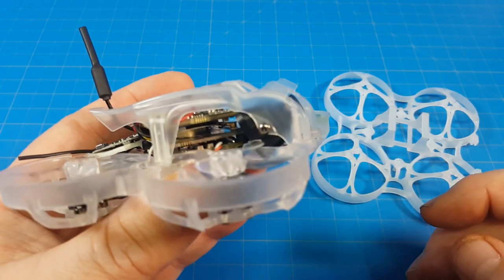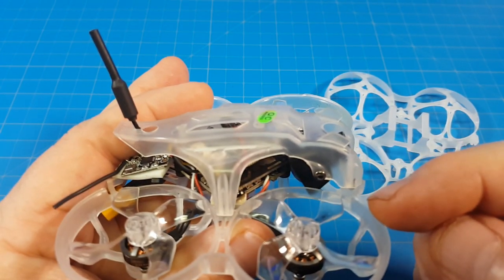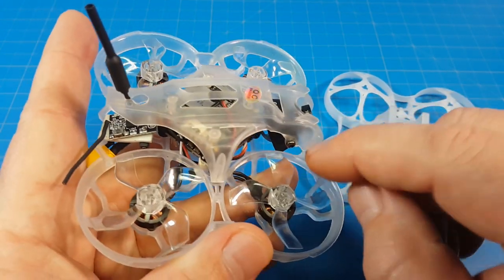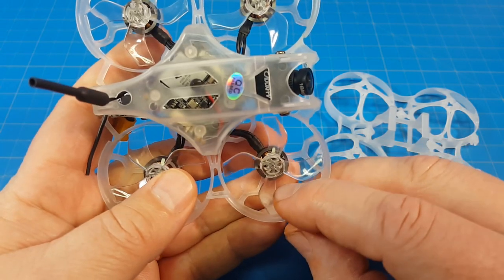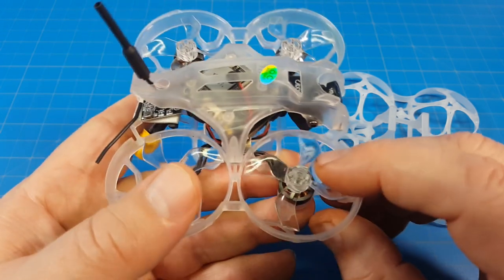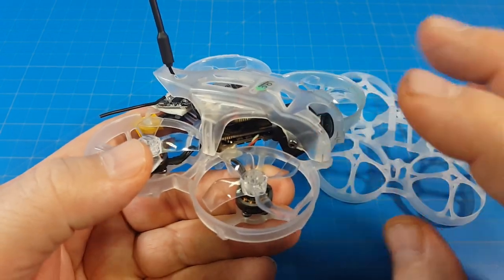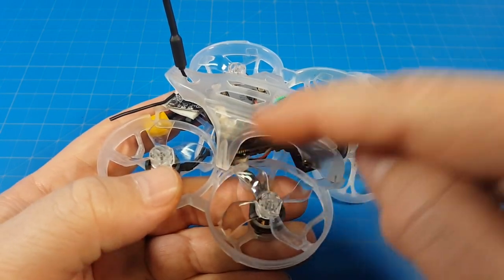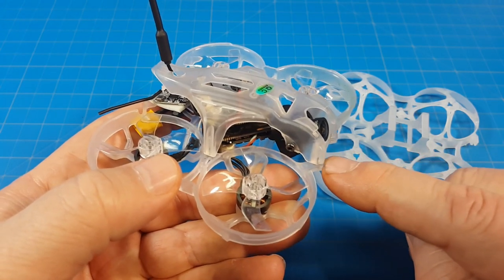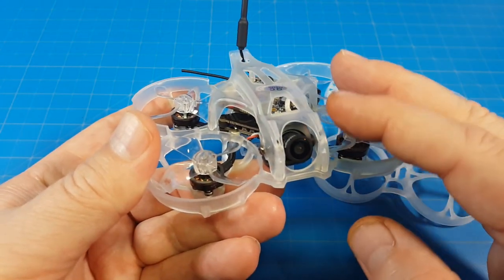Also, that prop is really close to the screw, although it's not in terrible shape as long as you get your prop seated fully. If you crash and bend a prop, when you go back to a fresh prop you've got to make sure you get it all the way down, or it may clip. Something to note: I do like that they give you several different canopies, because the canopy holds your camera steady. As the canopy gets banged up, the holes the screws go into are probably going to loosen over time, making the canopy less useful for holding the camera steady.